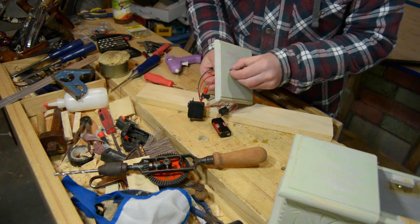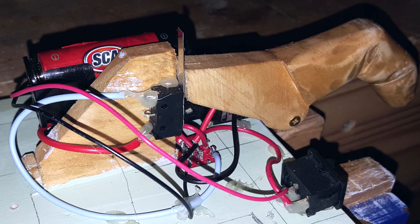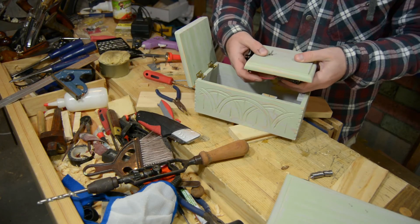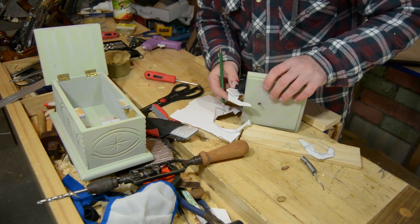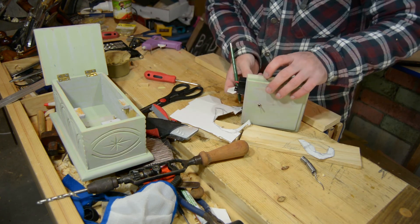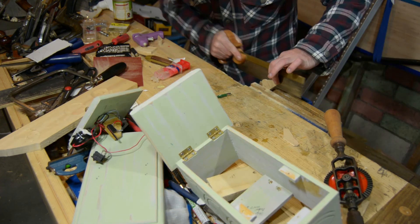To keep my life simple, and because I'm not used to this kind of stuff, I am going to attach all these components with a hot melt glue gun. That will give me the freedom to alter things as needed. I wasn't sure about the shape of the lever that goes on the servo, so I just cut pieces of cardboard and glued them together with hot melt until I came up with a shape that was close enough, then cut that out and shaped it up.